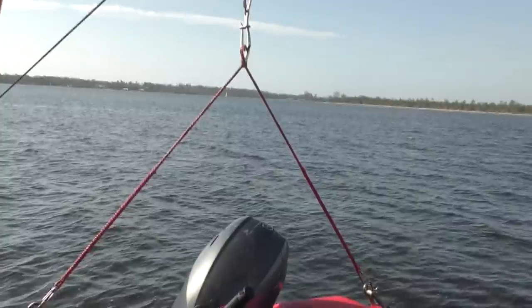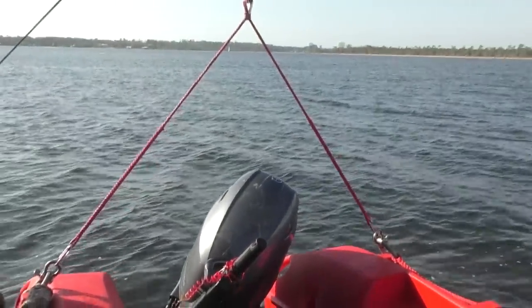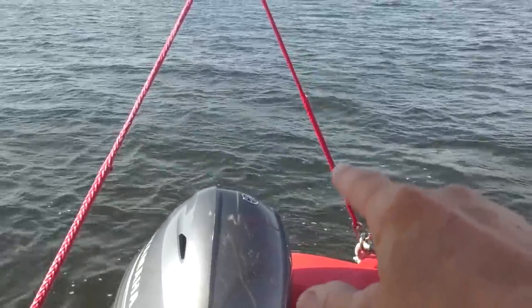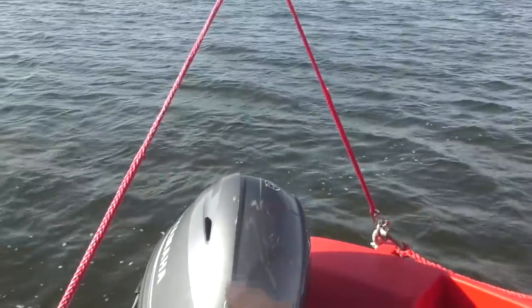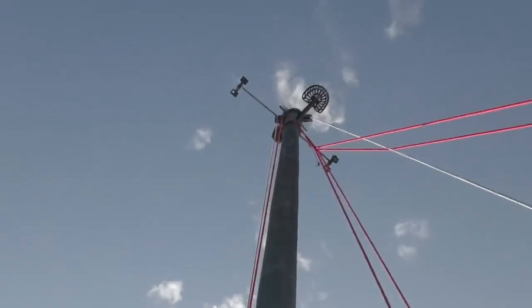I need to spread the load on this. Suggestions were to make a bridle - that's probably the easiest thing - but I need a lot of clearance. Bridles lose strength quickly as they start to spread wider, and that's really relevant here. The angle makes a big difference. When you get this angle down low, it starts making the line have a lot of stress, and here it would pinch the size of the boat incredibly. So a bridle works, but you need this long distance and I don't have that without it getting in the way near the top of the mast.